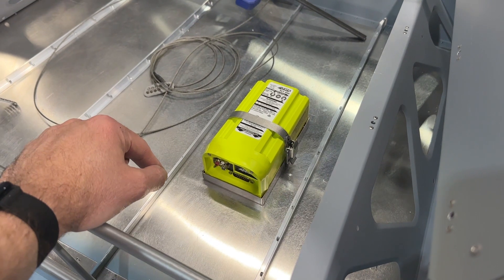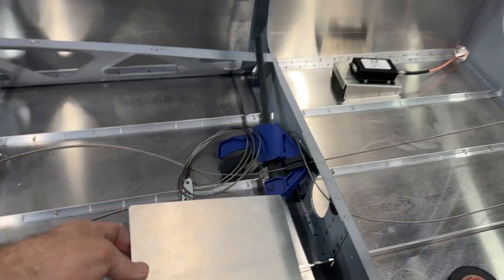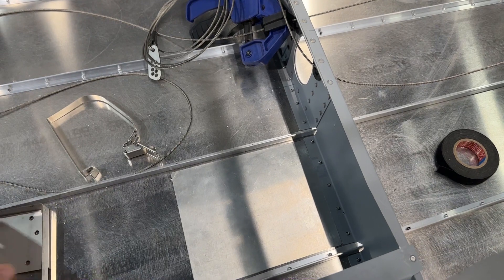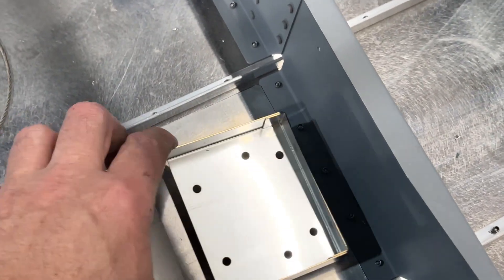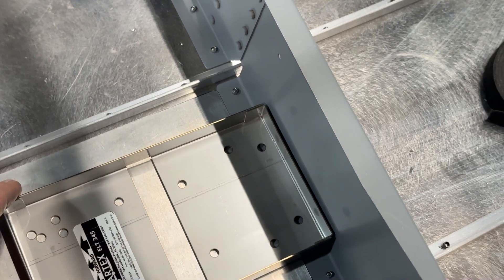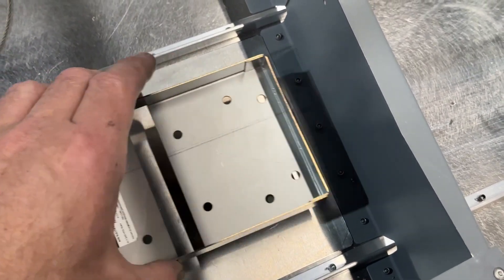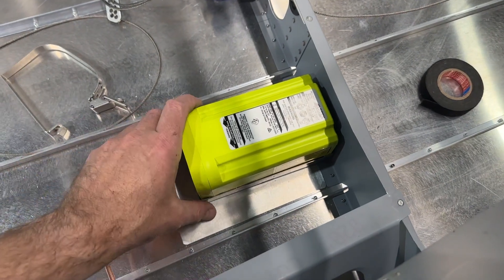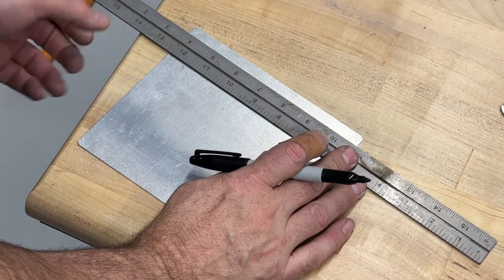This is where I've decided to put my ELT. I'm running the Artex ELT 345 - it's a nice lightweight compact unit. I'm going to put it behind between station three and four, under the aft baggage. I've got my doubler sheared up. I'm going to drill out these three rivets here, and when I rivet this in I'm going to use those three rivets on the flange of this bulkhead, then catch a few rivets through the doubler and the skin there. I'll run a couple of rivets for the doubler around here as well.